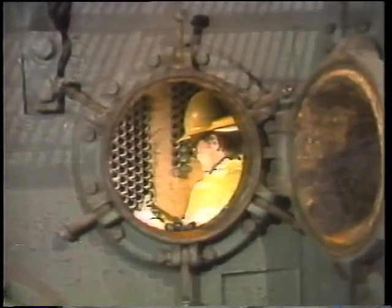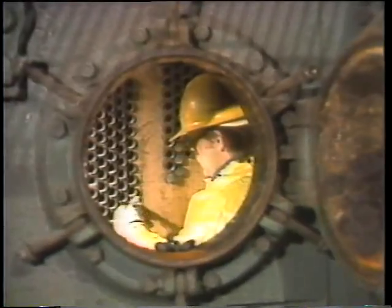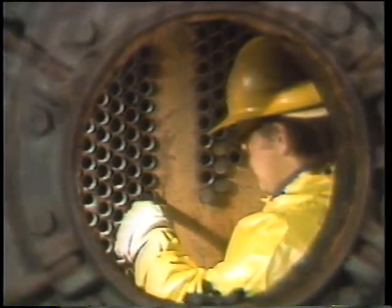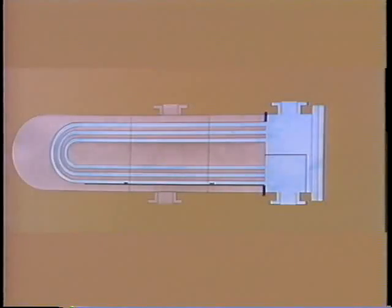It'll take a fair amount of time to go through this process over and over again on all the tubes in the condenser or any big shell and tube heat exchanger. The basic job is not much different on a large shell and tube heat exchanger. In the case of a large heater, shooting the tubes with high-pressure water and compressed air is good enough to remove small amounts of scale. With a U-tube heat exchanger, you have to think about what you shoot the tubes with — longer bullets or brushes can get hung up in the bend.